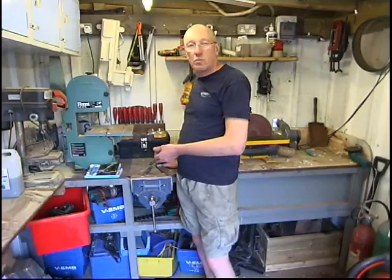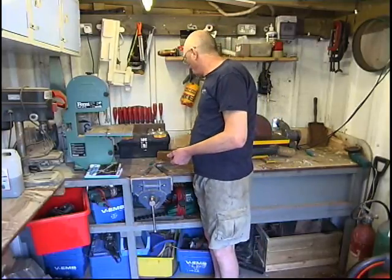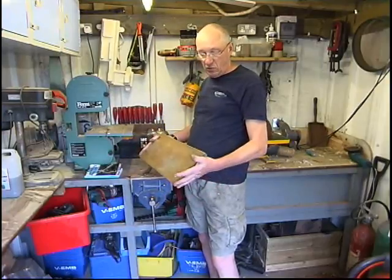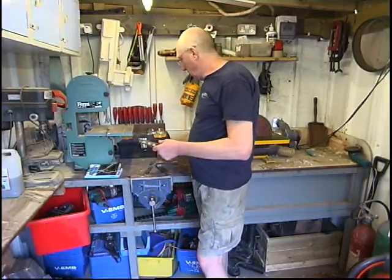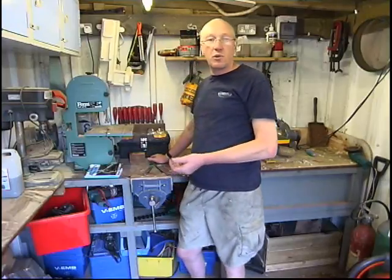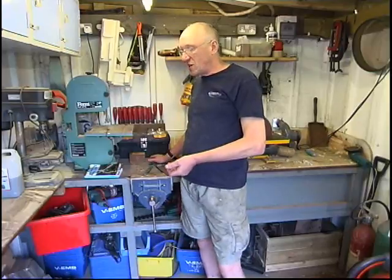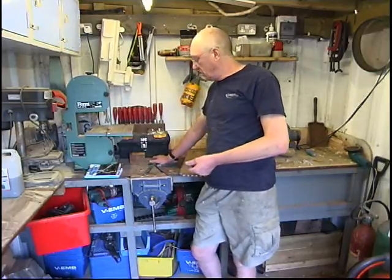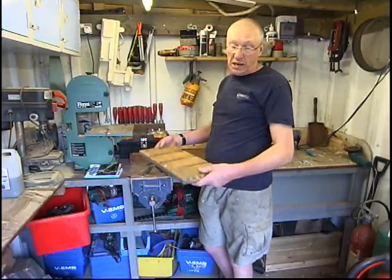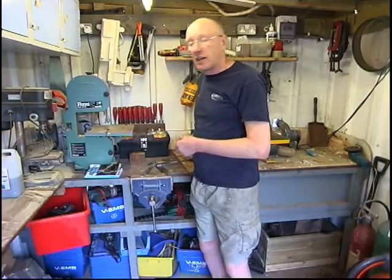Anyway, I don't like wood, but I'll show you how I get on making patterns. The first thing I want to talk about is wood. This is the sort of wood I use — it's actually oak, from a set of old oak shelves, very old. A bit of mahogany there. You can get scraps of wood from joiner shops. I don't use MDF. I used to — I made MDF patterns — but when you turn it and sand it, the dust is really bad for you. Horrible stuff, I made myself ill with it. The glue resin it's bonded together with is much worse than ordinary wood dust.